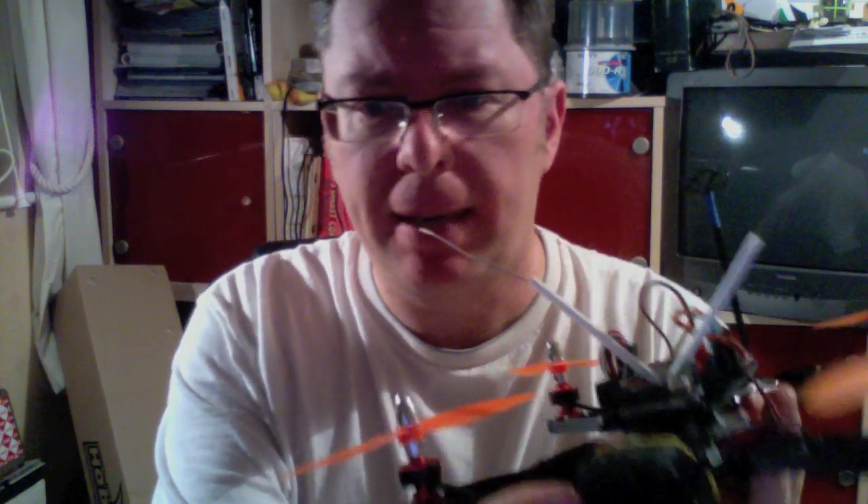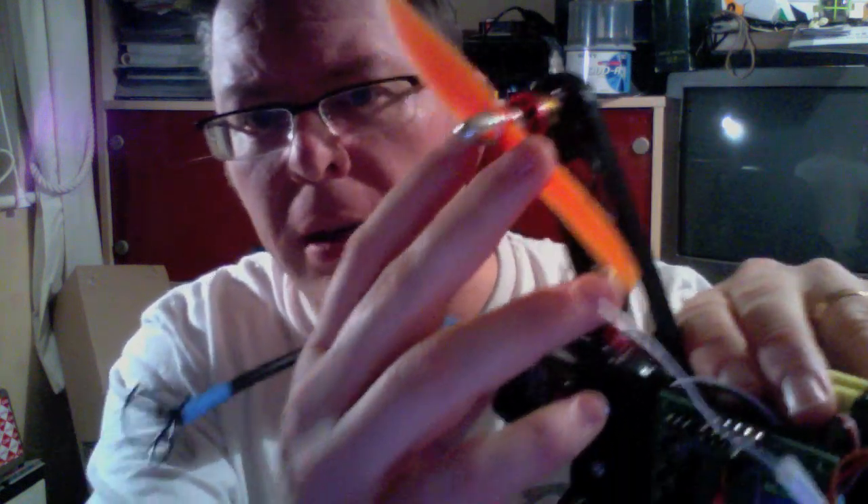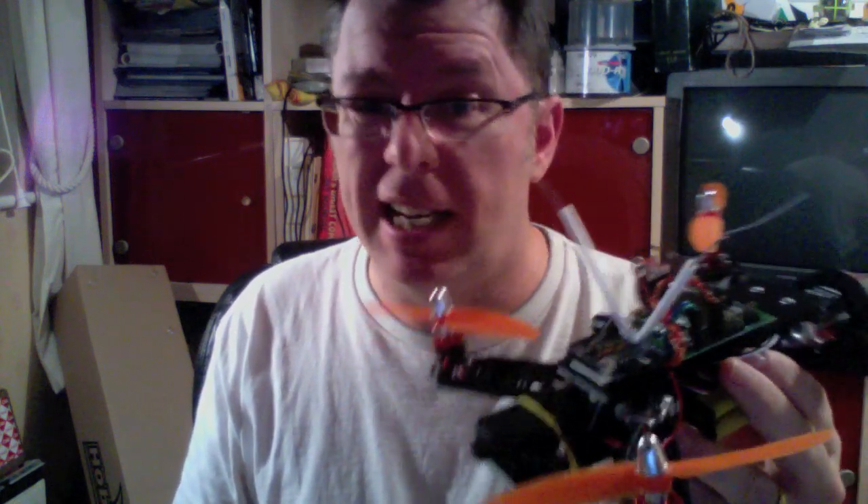So there you go — isn't 3D printing a wonderful thing? There are a few more things to do with this. The camera at the moment is just sitting on the plate, so that's going to get some sort of dampening mount. Long term I'd really like to try out one of the Mobius cameras, so I might swap this 808 out. The other thing is to swap these props — you can see this little white mark suggesting this prop's been in a crash, and all of them are looking a bit dodgy. Then it's just a case of flying it and doing more tuning. I'm really hoping once the weather picks up to really get out and fly the hell out of it — get a whole box of LiPos and just go for it, because it's really great fun. It's completely portable and it just goes. More to come hopefully. See you soon.